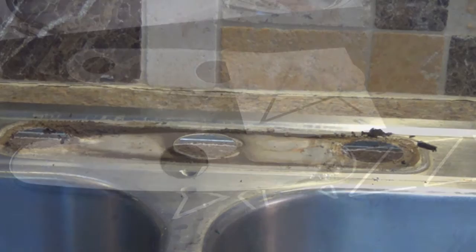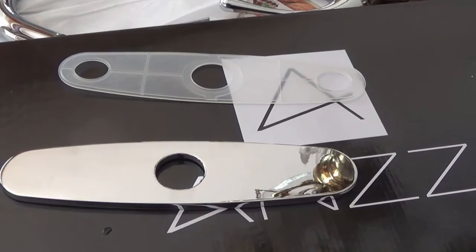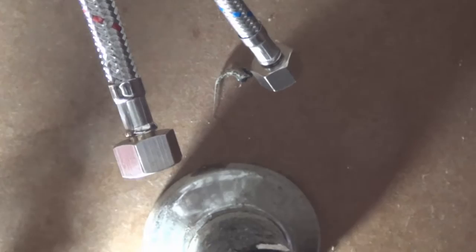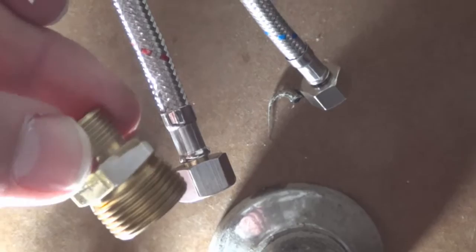Alright, we're going to go on to plan B. The old trim piece is just not going to work out because it's just kind of too banged up. Fortunately I had this one laying around, so I'm going to put this one in its place. My supply line has a female fitting and my new faucet has female fittings, so I had to go back to the store and pick up a reducer to connect them together. Look at what you've got down below the sink before you start the project and save yourself some time.